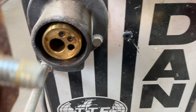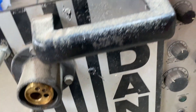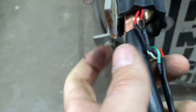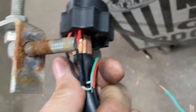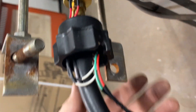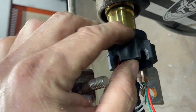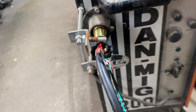So the next step — I finished drilling a hole and put a little grommet in there for now, but eventually I'm going to drill that out larger for the toggle switch. Then I stuck this in, lined it up as best I could, and checked where the little set screw was. There's a factory slot in this for the set screw. I made another slot two notches over, which should put it around the bottom roughly, and then I'm just going to run the wires right in through the grommet.